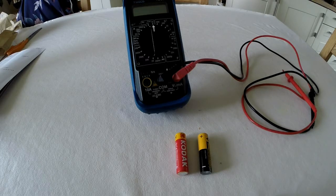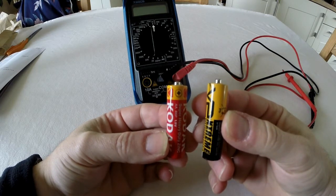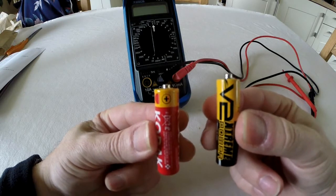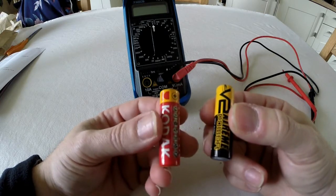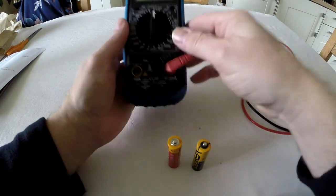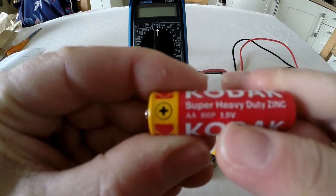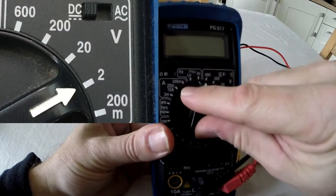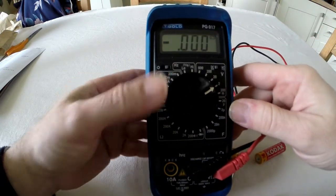One of the first things that can go wrong is your batteries. If you're using standard disposable batteries you can just replace them, but if you found some in the cupboard and aren't sure they're good, you can test them. Look on the side of the battery — it says 1.5 volts. On the multimeter, set to the 2-volt DC range. Batteries are always DC, so turn it on.